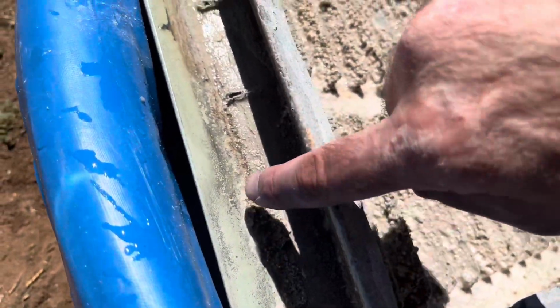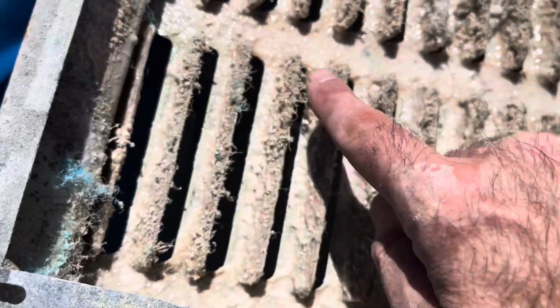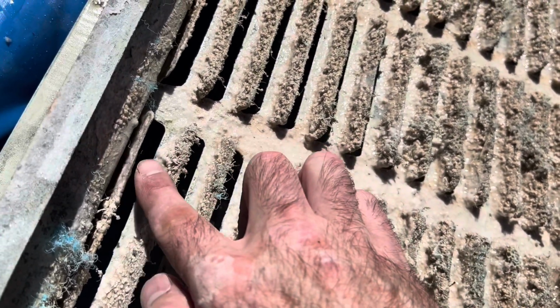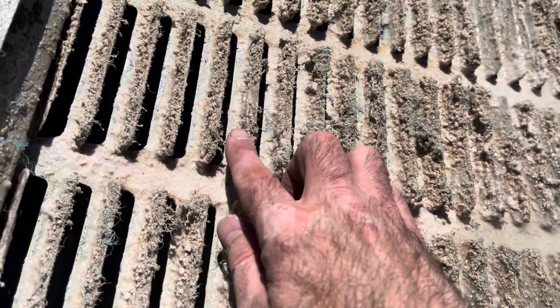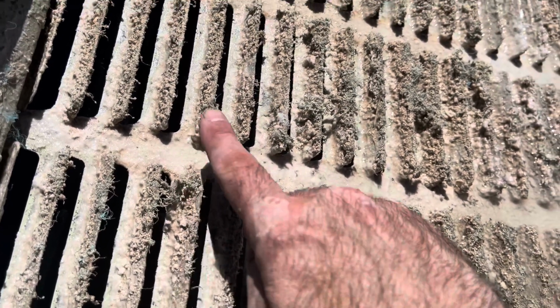It's fed in by the spiders. It goes in through the weep holes, soaks into the media, and runs down to the bottom and out to the basin. These louvers make sure that the water doesn't spill out of the swamp cooler, but gets redirected back into the media.